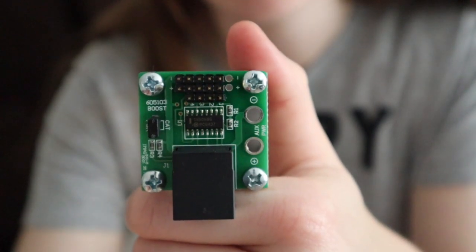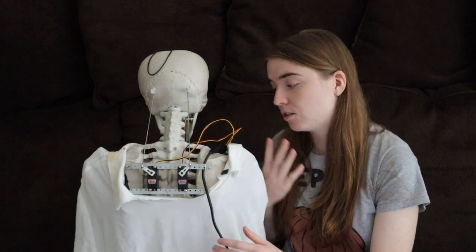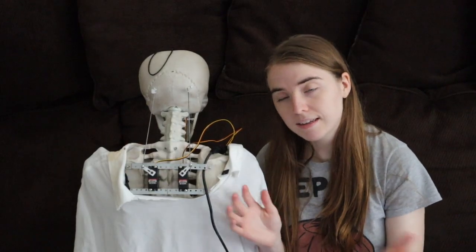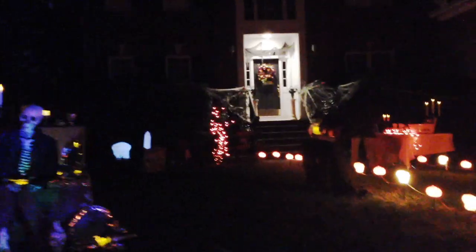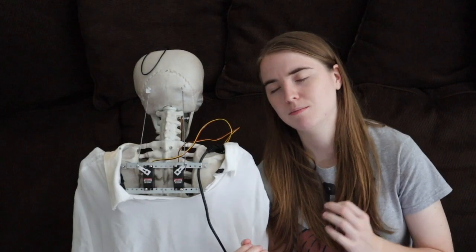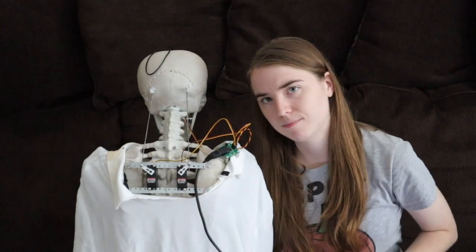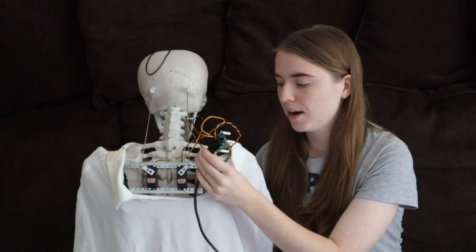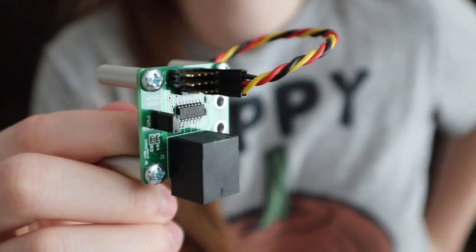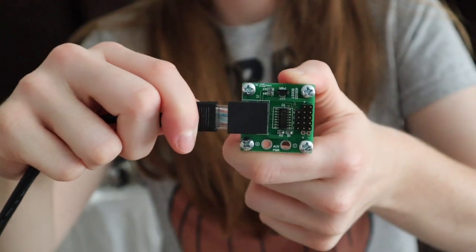This is a Cat-6 boosted receiving board. I'll include a link in the description to buy them, and you'll want to get a sending board to go with it as well. These boards are nice because instead of plugging your servos directly into your controller board, you can lengthen the distance between your controller board and the servos and use an Ethernet cable to connect them. For example, the pirates are all the way in our yard while the computer and the controller board are inside the house where they're safe from moisture, which is important because it gets very dewy around here on Halloween night. Each board can handle four servos, and each pirate right now only has three servos, so that means one board pair — sending and receiving — per pirate. Plug in your servos with the yellow wire facing inside, make note of which pin belongs to which servo, then just plug in your Ethernet cable, and you're good to go.